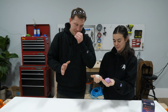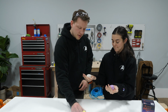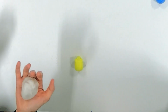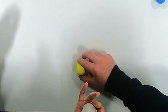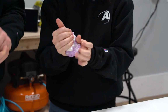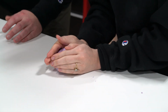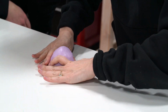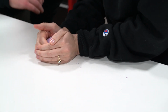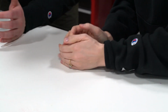Okay, so here's what you're gonna do. When you start mixing together, mix with your hands. You're gonna go, go, go, go, go. You're gonna have this part ready where you want it to be. So we're gonna put that right there. I'm gonna pull it back a little bit so it's within our camera frame. Here it is. When you've got those two mixed, you're gonna ball it up, and then just kind of press it down on top of the skull. And you're gonna slowly work it down. It'll still be that Play-Doh consistency, and you're just gonna let it be a little bit of a ball over top. You'll squeeze the sides of it, making sure you're pressing everything against the part.